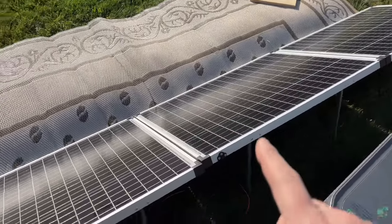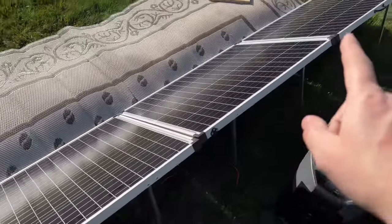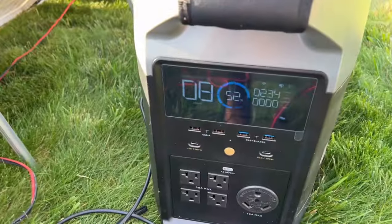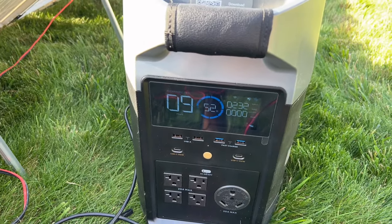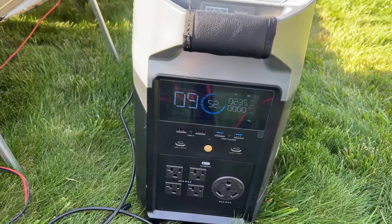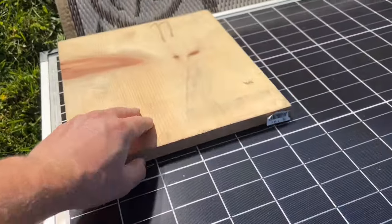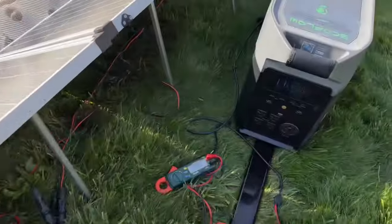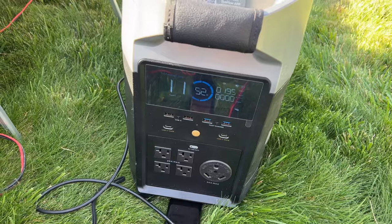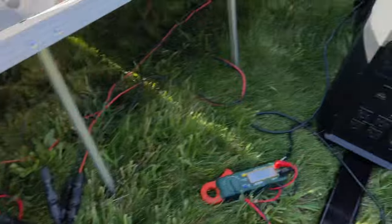Now I've hooked all four of these panels up in parallel. That increases our amperage — 5, 10, 15, 20 amps. These are good for short-run type off-grid sheds and buildings, and you can still use this in other applications. There's a vapor trail passing in front slightly, but look — about 240 watts give or take. Now we'll put this block down. In a series connection this would basically be no output, but we were at about 230 and now we're at about 195 watts.